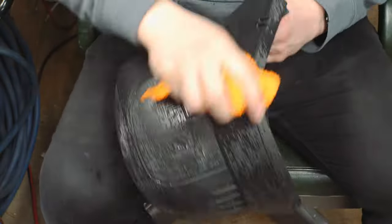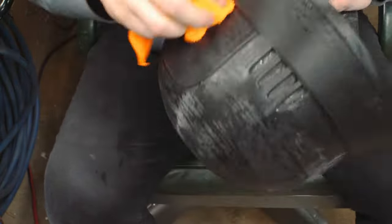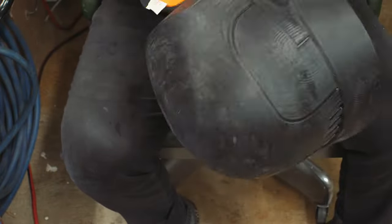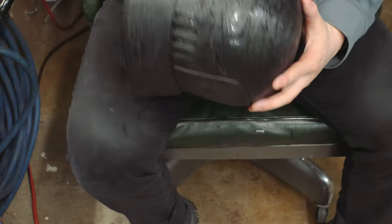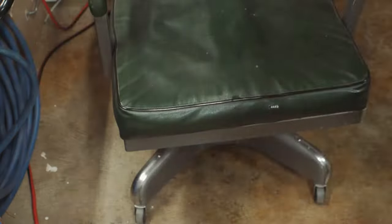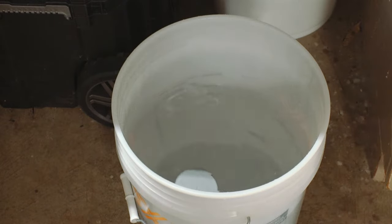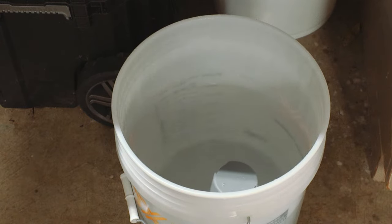When all the sanding was done, I went back with a damp microfiber cloth and removed as much dirt as I could. I ended up turning on my air compressor and blowing out the water from the microfiber towel, and also to get any dust in nooks and crannies. Pro tip: before spraying out of a spray can, put your can in a bucket of hot water — this will help the paint flow a little smoother and hopefully lend itself to even coats.